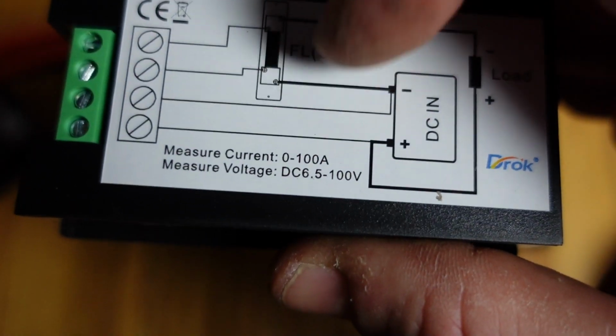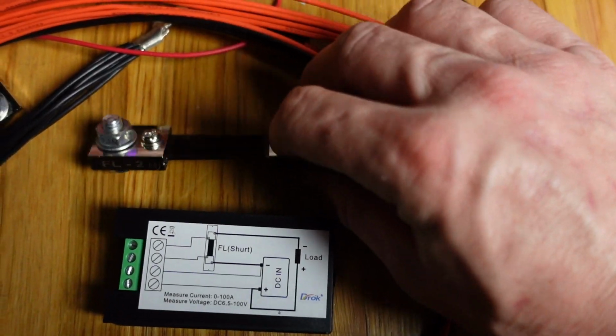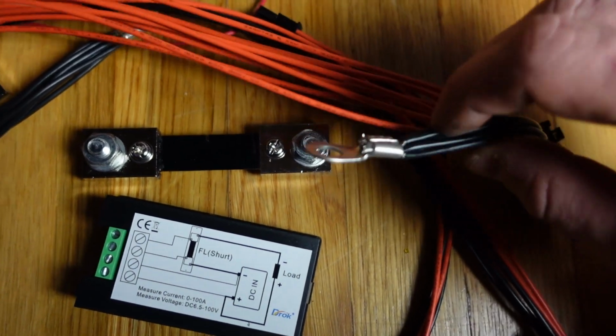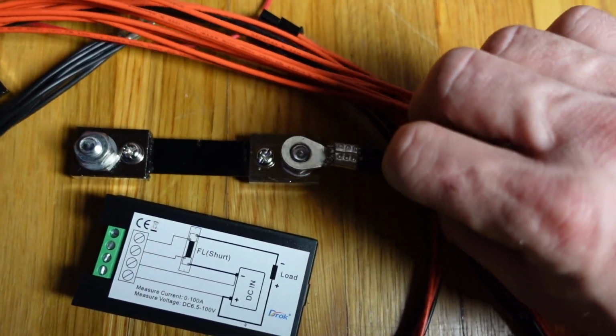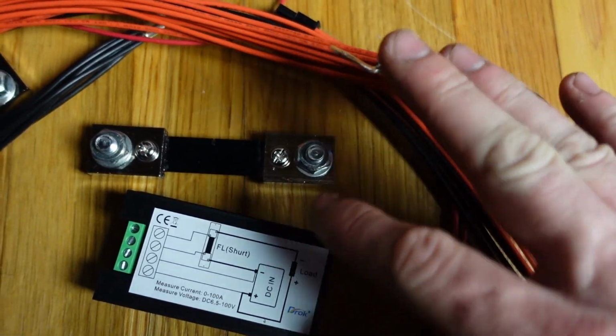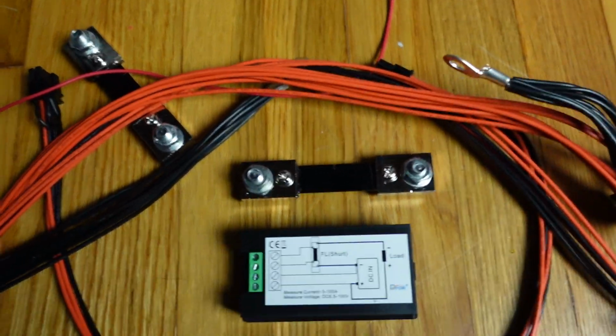You want to make sure you do that, and you also want to make sure you get the ground. You don't want to put the ground on the same screws here. You want to get the ground over here for the meter. So you could crimp an extra wire into this connector, or you could put 2 of these connectors down on here and have another wire go over to the meter. But that's the way I'm doing it inside of these boxes, right?